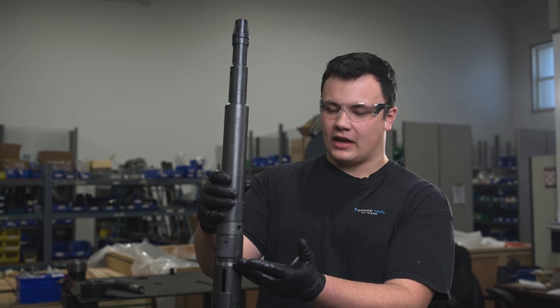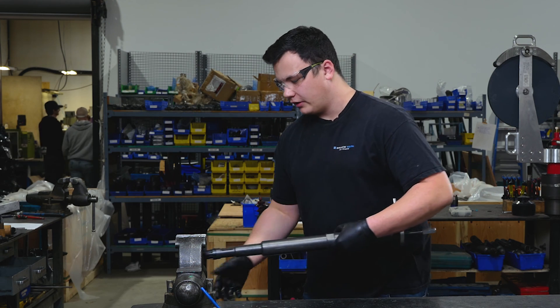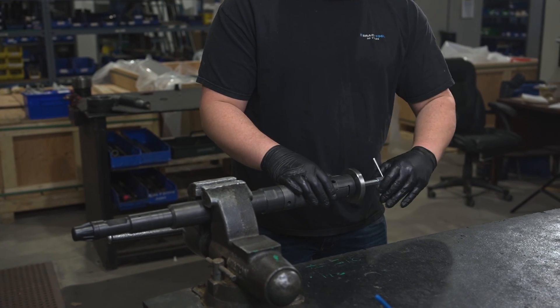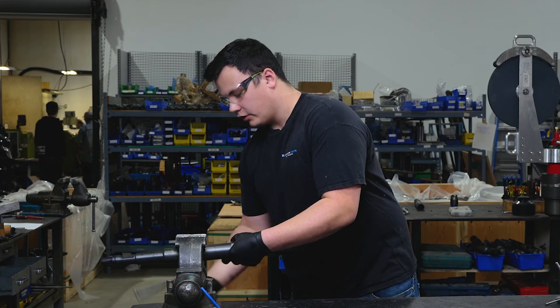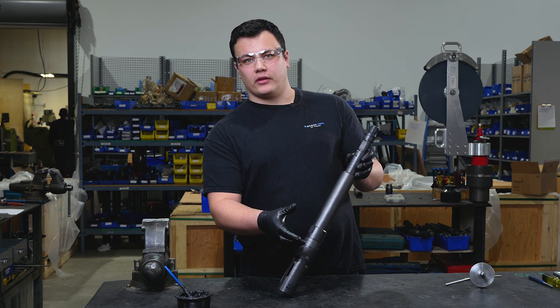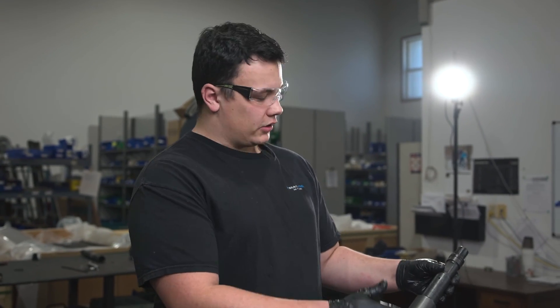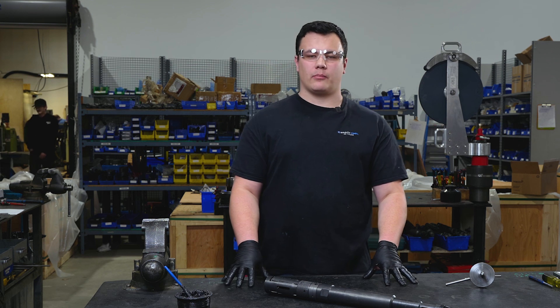Now that our upper cylinder is attached to our lower cylinder, we're going to remove our core extractor from the vise, placing the upper cylinder of our universal pulling tool into the vise and removing our core extractor. To tighten your upper cylinder against your lower cylinder, simply install a punch into the service hole, apply a crescent wrench to your upper cylinder, and torque against each other. Once you've completed that, this tool is now assembled and ready for use. You're free to select your shear up or shear down position. Thank you for watching my assembly video — I'm Paul Jensen.